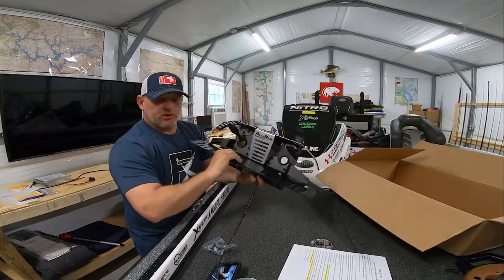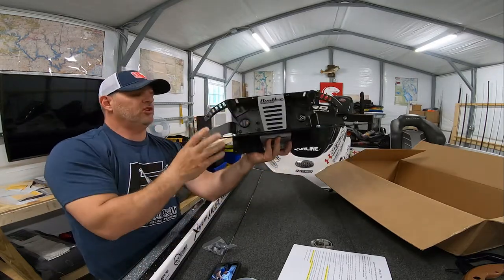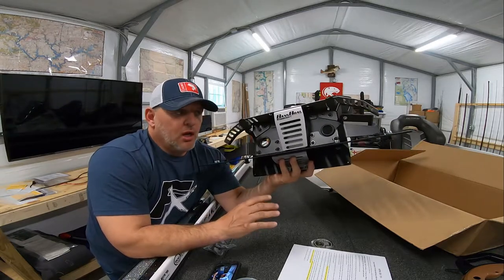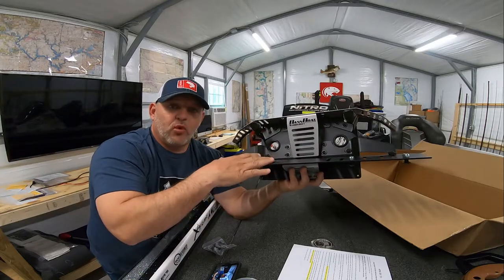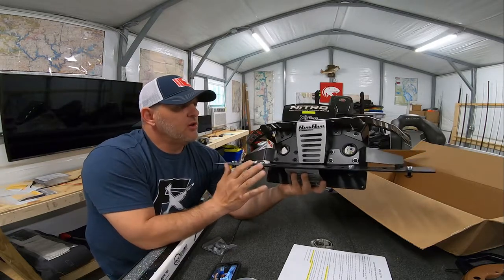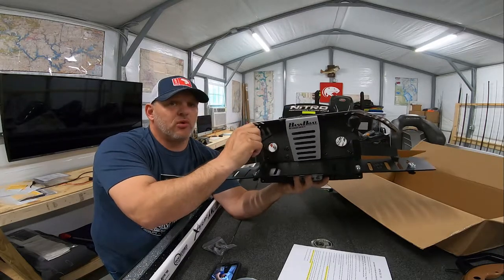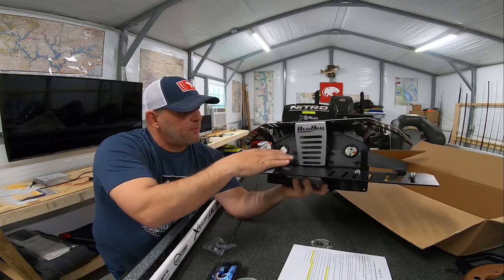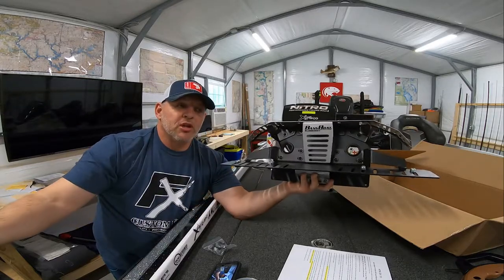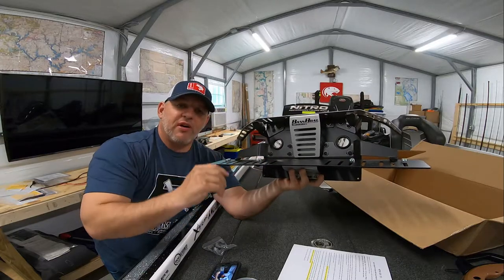Here it is — really nice. They give you the hardware to mount your gimbals. The gimbals don't come from Bass Boat Technologies — those come from your original manufacturer, so Humminbird in my case. But they did supply the locking nuts and bolts for the mount. Really nice. There are some bushings here too — in case you hit rough water, you don't want your unit coming back and hitting something hard, so there's a nice rubber grommet. Just feeling this thing, I can tell they really beefed up the support compared to the single mount. With a couple of big units hanging off to the side, you really want that rigid design to keep vibration out.